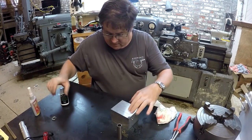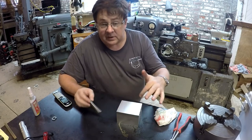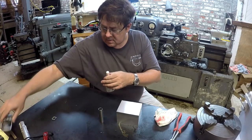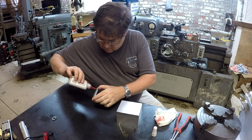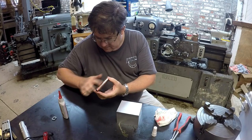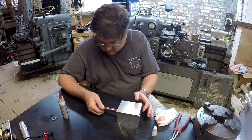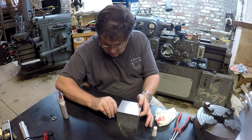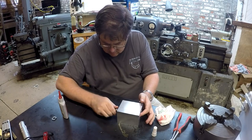We've got both of our bushings made here, and they're going to go in the block like so. I've cleaned the ID of the block, and I've cleaned the exterior of these bushings with acetone, let them dry thoroughly on an oil-free surface. A little in there. When you don't have threads, this is really more of a retaining compound, you don't have threads to work with, apply liberally. Insert with a twisting motion to distribute. Insert in the right direction. There we go.